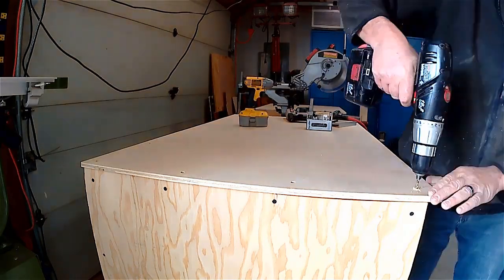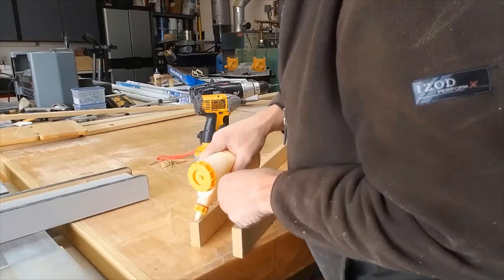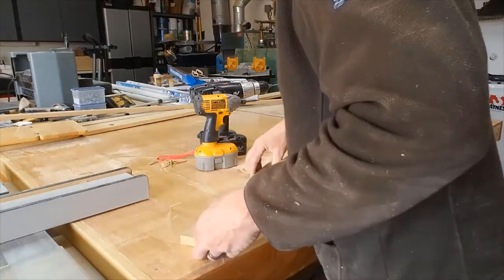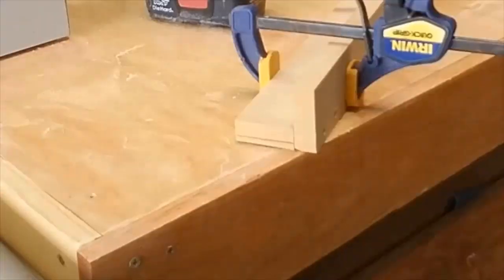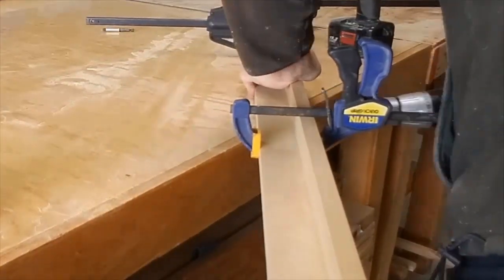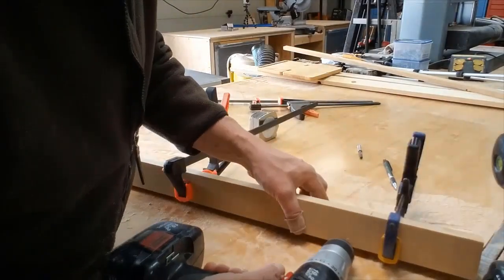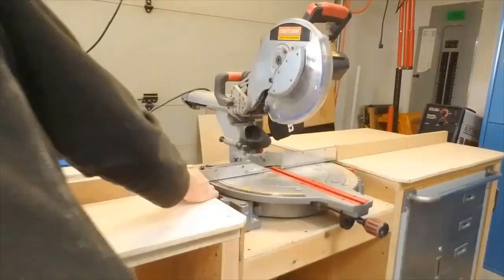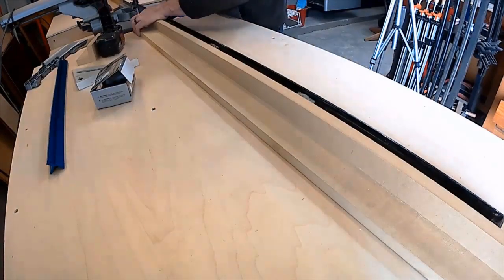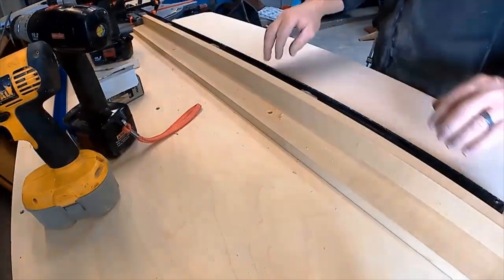I'm using a pretty nice maple plywood here — probably the most expensive piece of wood in the entire build, about $55 for a four-by-eight sheet of half-inch, but it works great. Now I'm putting glue on our stop. This is going to be our miter track — the Accu-Track system from Kreg. I'm using two three-quarter-inch MDF pieces glued and screwed at a 90-degree angle to make a nice rigid fence. I'm making the whole length, and once all the screws are installed, I'll take the clamps off, take it over to the table saw, cut each side to length, and set it in place. Once it's roughly set in place, I'll take my level across the fence to make sure it's level, then pre-drill and screw it into the top all the way down on both sides.